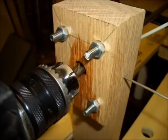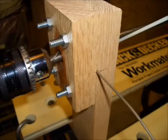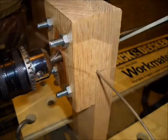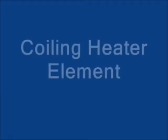I put a 90-degree bend in the resistance wire just inside of the jig. This allowed me to bring the resistance wire out of the front of the jig and insert it in the chuck of the drill. This effectively fixes the end of the wire to the 3/8-inch diameter steel rod and causes the wire to wrap around the rod as the drill turns the rod. As the wire wraps around the rotating rod, the jig forces the wire to wrap in a single layer. At the same time, the newly laid wrap of wire forces the previously laid wraps out of the front of the jig along with the 3/8-inch steel rod.